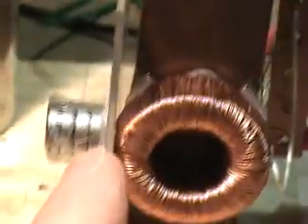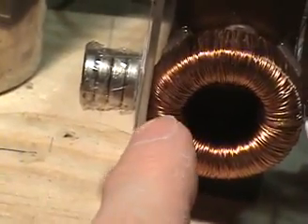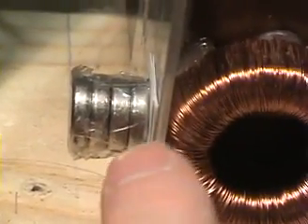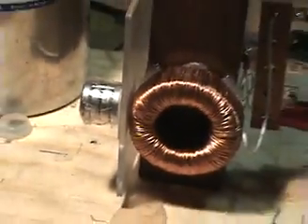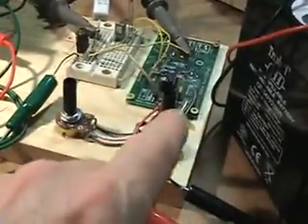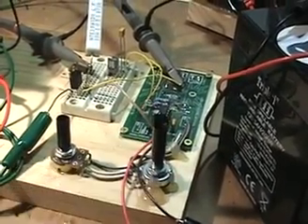There's a small plastic glass sheet that I've added to create a space, or an air gap, between the magnets and the toroid. This is exactly at the halfway point between the two sides of the coils, where I seem to be getting a nice effect. There are also some very thin pieces of paper that I've been using for fine-tuning — adding paper to get the gap to the best level I can get the effect going. I'm using a 555 circuit, which is a PWM setup using a 555 timer.